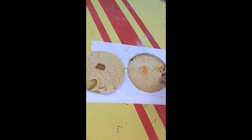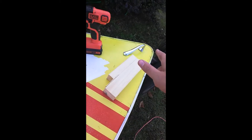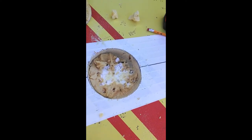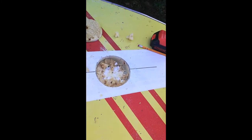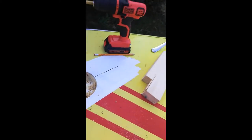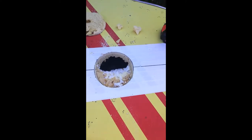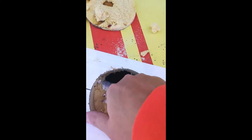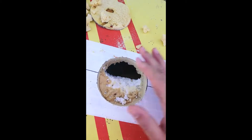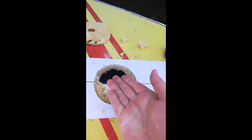I just popped it off and there's foam everywhere, but it's not wet — which is a good thing. I'll chip out enough foam to get my hand in to place the backer block. I worked through that initial brown spongy foam layer and got down to a white block of foam. I believe there are foam blocks situated inside the Sunfish hull. The white foam actually goes all the way down to the bottom of the boat, so I prefer not to cut too far into it since it's a structural stability piece. I'm going instead into the side to still get my arm where it needs to go.